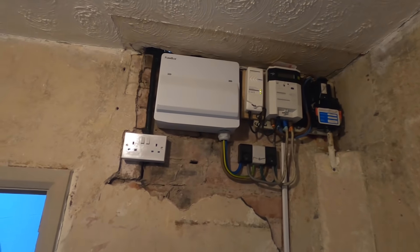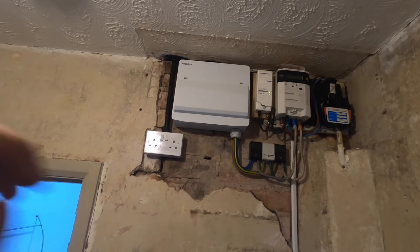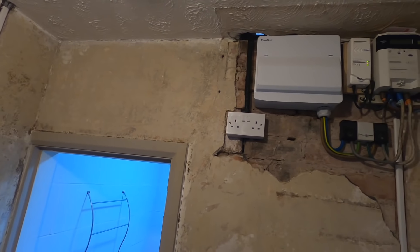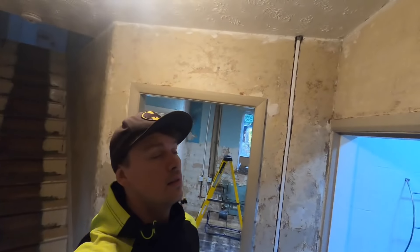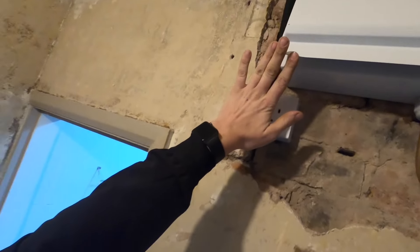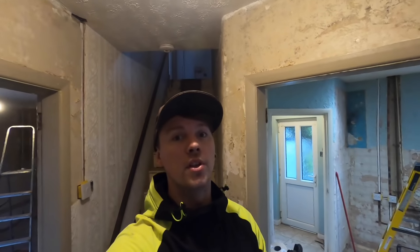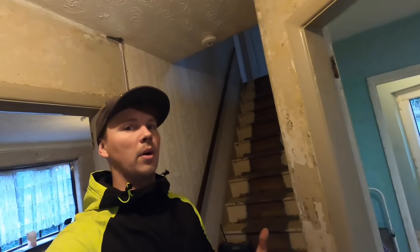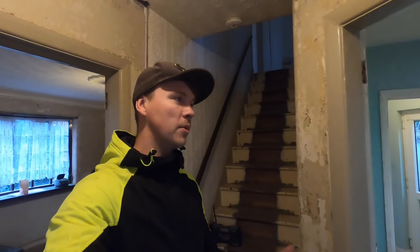So now I'm running around the job. This is what I did with the board — I didn't really have much choice. The plaster came all loose; you can see the previous board up there. Loosey blocks went in, new fuse box board, and obviously a bit of flexicon for a socket up there. He wants to put the Wi-Fi up there but I said probably not the best idea because you'll get interference. I'm going to label it up. We've only got the downstairs lights on at the moment — it's just me and Adam working at the property, so I'm not concerned about someone turning the lights off while we're working upstairs.